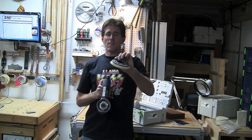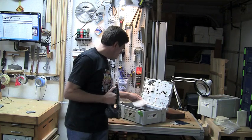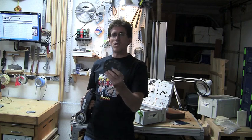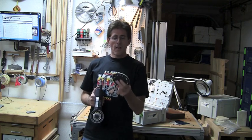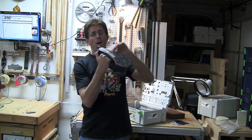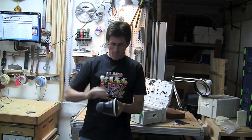This one here is the semi-soft pad that comes with the sander. There is also a hard pad that you may choose to use. This one here is significantly harder. This is nice when you're trying to do some of the initial work, and I'll show you that also when we get to the demo. And it helps in trying to keep flat. So you would just put the pad back on, again press the ratchet lock, and give it a turn until it locks into place and away you go.